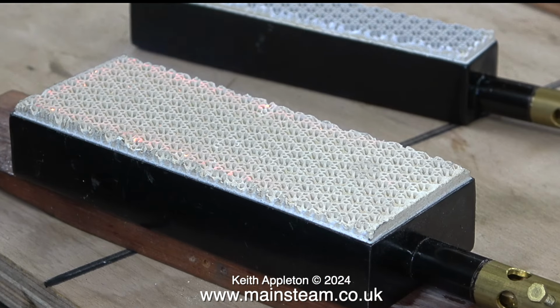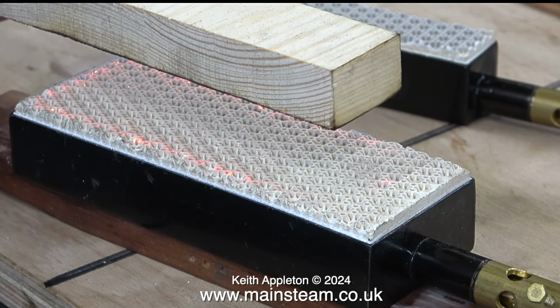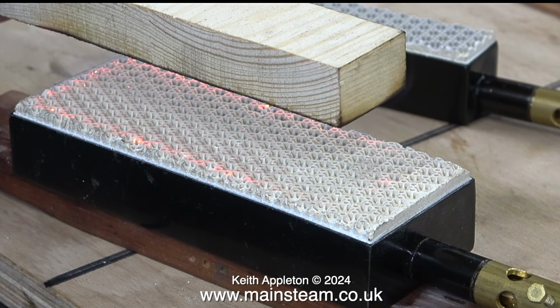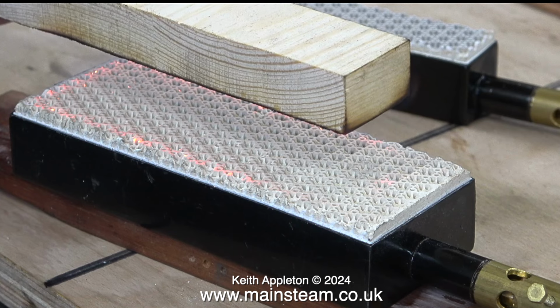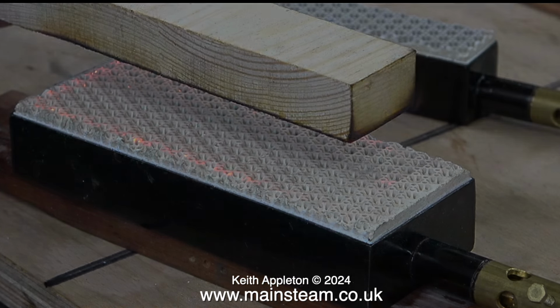I'm going to try this same number 8 jet on the larger burner for a 504 boiler. It's a bit on the small side. I think these larger burners are designed for a number 10 jet, but it's burning this piece of wood quite well. And as you can see, I have the gas jet pushed quite a long way into the Venturi tube.